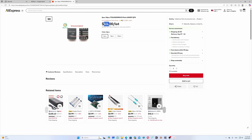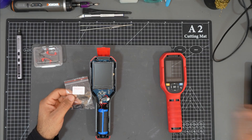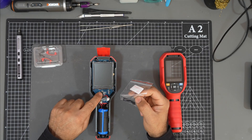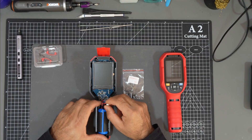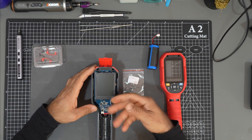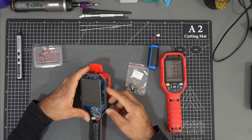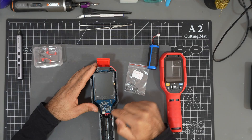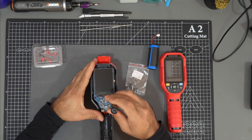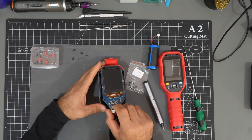It's not that expensive so I'll order one and we'll install it together. The part has arrived — part number TPS630250. Let's take out the faulty IC and replace it. Do we need to take the board out? Let's take the screws and lift it a little off the case. There are sensors here I don't want to disconnect, and a screw might conduct heat to the case and melt the plastic.